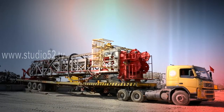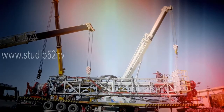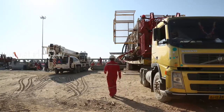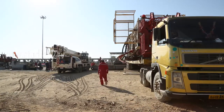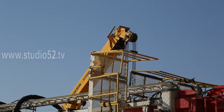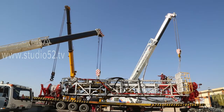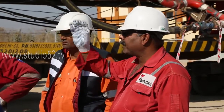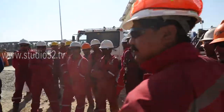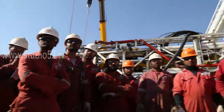In this section of the video, we'll cover the proper handling of masts using cranes. The assembly and disassembly of masts contribute to many hazards in the workplace. Any lift operation using cranes should use caution, but that's doubly true for tandem lifts using two cranes — in such cases, an even higher standard of supervision and attention to detail is required. Ensure that lifting supervisors and tool pushers are present to manage the movements of all loads.